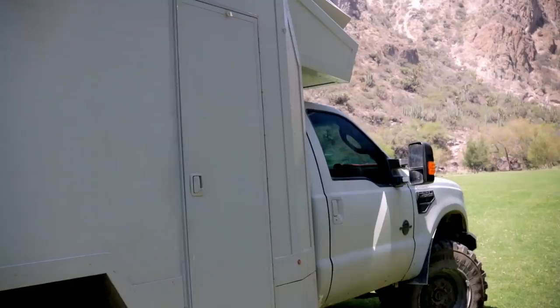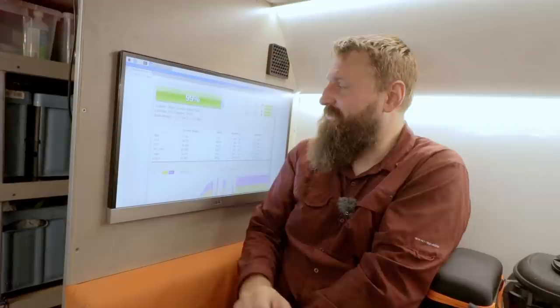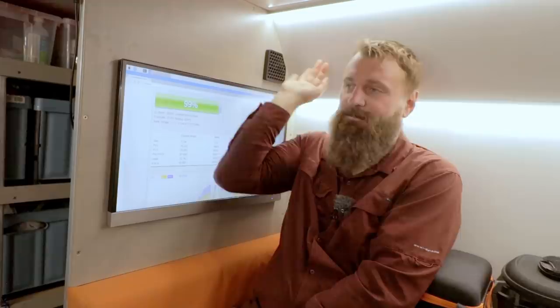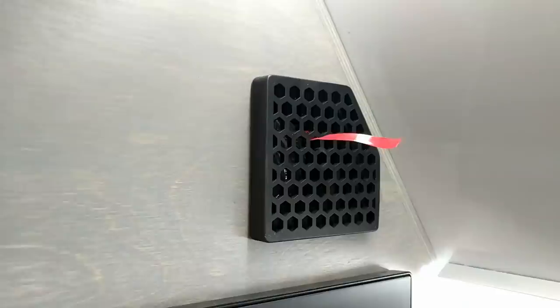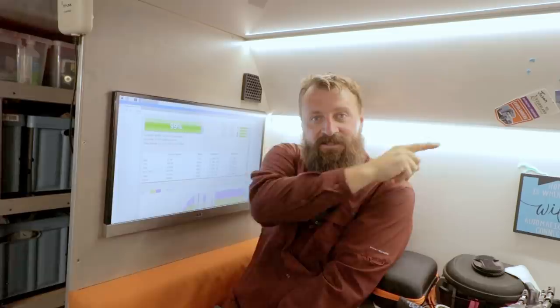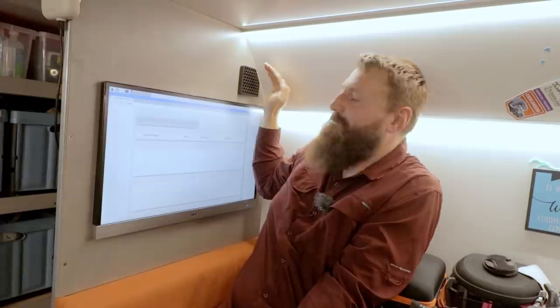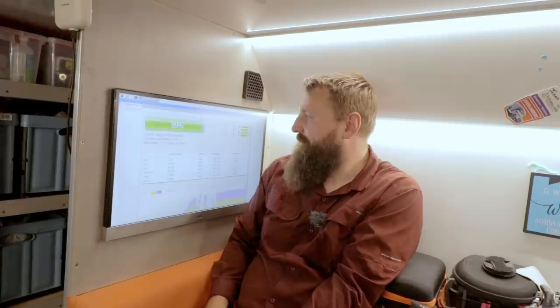Let's go inside and look at the air handler unit. Here is where the business end of the air conditioner comes out — I 3D printed this vent which shoots the air down into the room into the main living area. One little regret is that these holes are tubular and so long that it really laminarizes that air and shoots it right down the wall, so out here you don't feel the breeze but here you do. It still keeps the room cool, but if I were to do it again I'd point the tubes more towards the middle of the room.